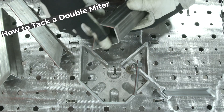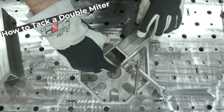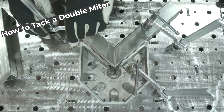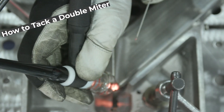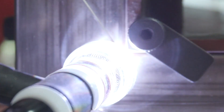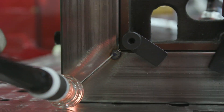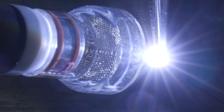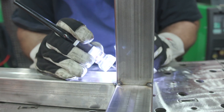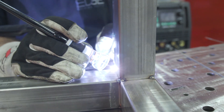Seeing as the points are like this, if you fit it up from the bottom side you won't be able to get a tack on the outside, so I always fit it up from the top side. After clamping down, I put a tack right on the corners. I use all the clamps! I'm going to tack on the corners as close to the point as I can without going into the point, because I don't want it to melt over. Once it's tacked up, there's really no difference between the two — you're just welding it out.